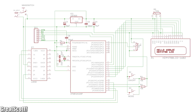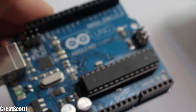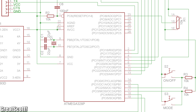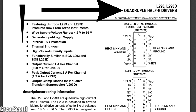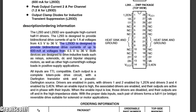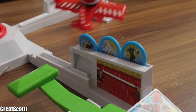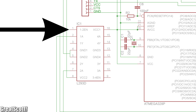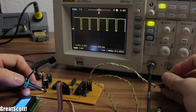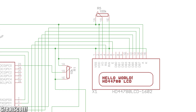So let's use 9 volts. Here is the schematic I made for this project. It looks complicated, but let me explain. The first IC is an ATmega328P — you also find them on all Arduino UNO boards. This controls everything. The second IC is an L293D, which is an H-bridge motor driver. It can handle 600 milliamps, which is more than we need, and it can control the motor in both directions — forwards and backwards. The backwards mode gives the game a short break because the pilot doesn't knock over the chips. Pin 1 receives a PWM signal from the microcontroller to control the speed, and pins 2 and 7 determine which direction the motor spins.